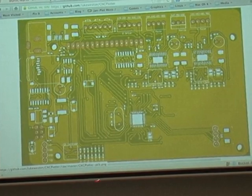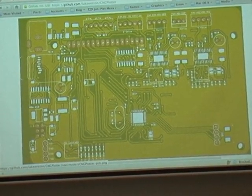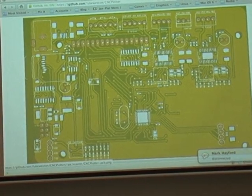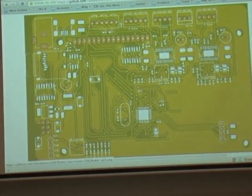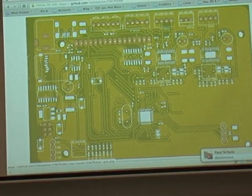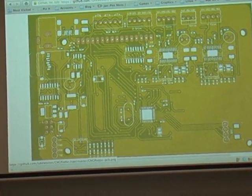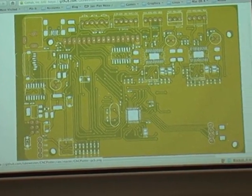You've got your stepper motor drivers here, two trim pots that adjust the current regulators in the stepper drivers. I noticed when we soldered them in, we didn't have to adjust anything. Yeah, when you buy a trim pot off the shelf, factory stock like that, it comes set in the center 50% position, and it just happens that we got lucky with that, that it's a nice value at that point, which is good user experience.